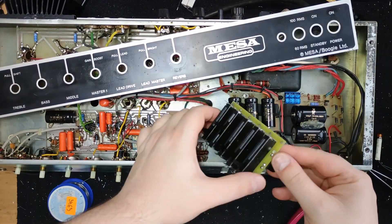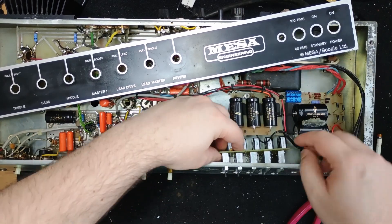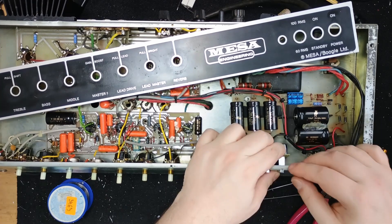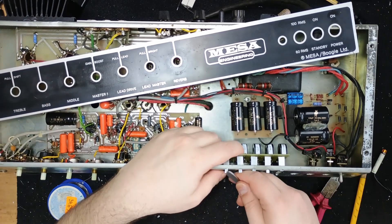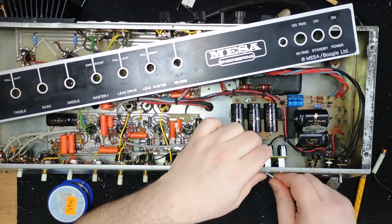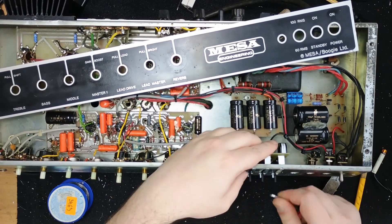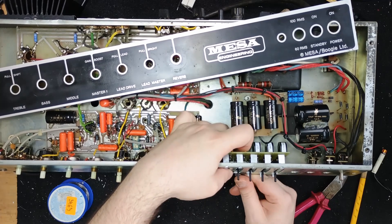Now let's mount the slider board. The sliders offered today don't have mounting tabs, so I had to make some manually. Using a thin sheet of metal, I cut small pieces to a specific shape, bend them around the metal housing of each slider, and then solder the edges where they meet. This holds them tight and secure. Now I can mount the slider board like on the original amps, by bending the tabs through the chassis without having to drill new mounting holes.